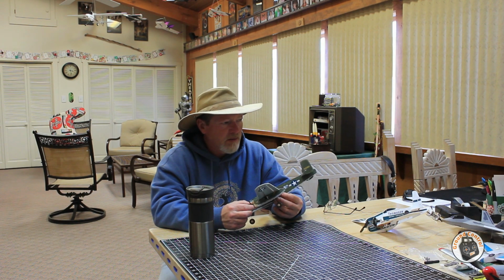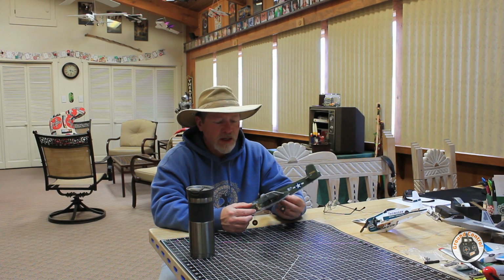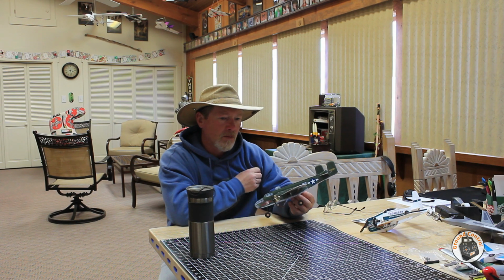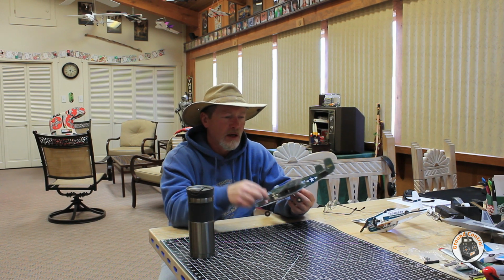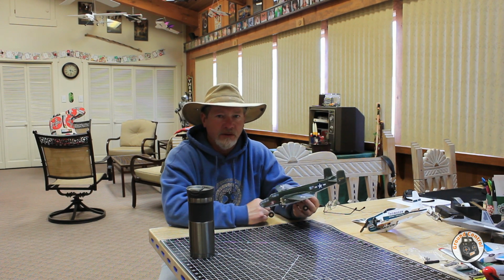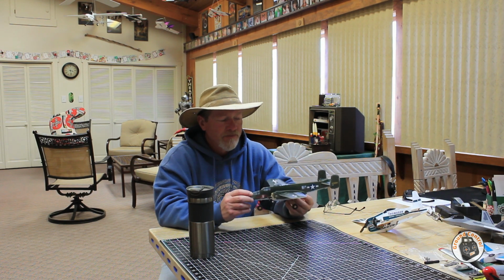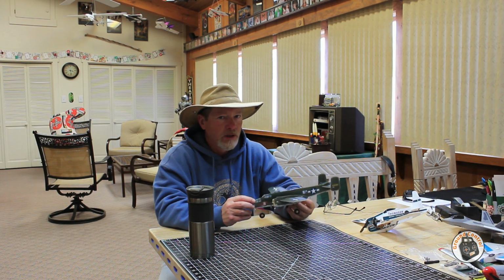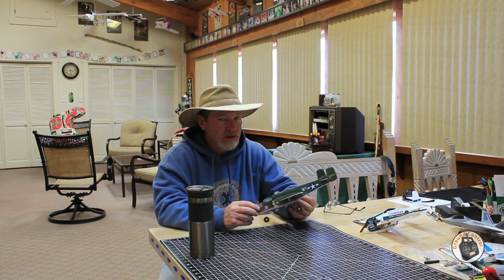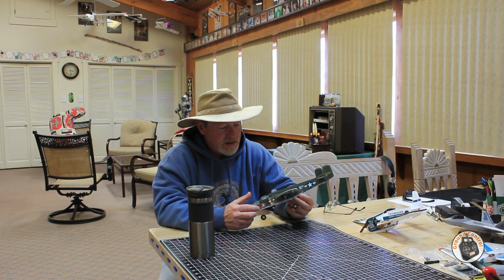But I will take my 8520 motors and put one of these props on it, put it on my thrust stand just to see, because I was kind of worried about that. These motors with the stock props on the thrust stand were only putting out 17 grams of thrust. That's only 34 grams of thrust total between the two motors. And the all-up weight on the plane was 40.3 grams, so not even close to a 1-to-1 thrust-to-weight ratio. So I will be replacing these motors.